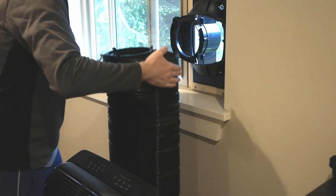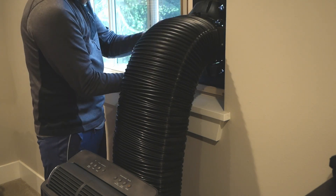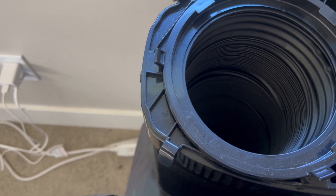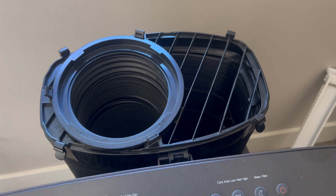Finally asking the question led me to a dual-hose inverter-powered portable — it's the next step up in terms of noise and efficiency. They're generally more expensive than single-hose ACs, but absolutely worth the difference in price. Like the previous unit, they're relatively easy to install and work in both horizontal and vertically sliding windows. We do still have the issue of compressor placement — it's still indoors, which isn't ideal — but by using two hoses, we solve the glaring defect of single-hose units. We are no longer drawing warm air into the room to cool the condenser coils. With an intake and an exhaust hose, they will continue to cool effectively even when it's hot outside.